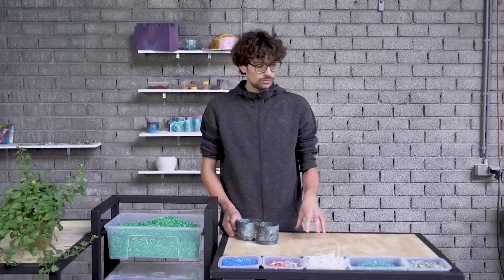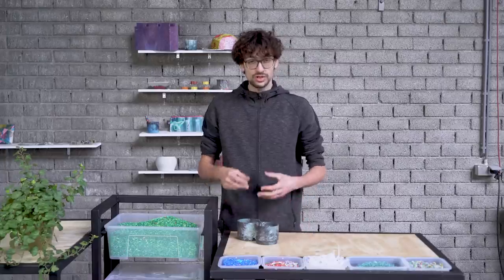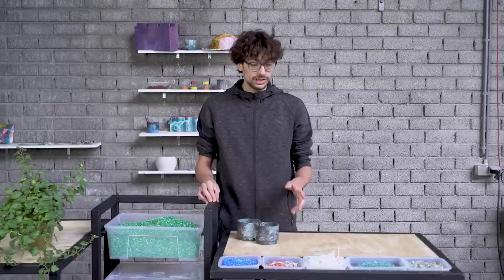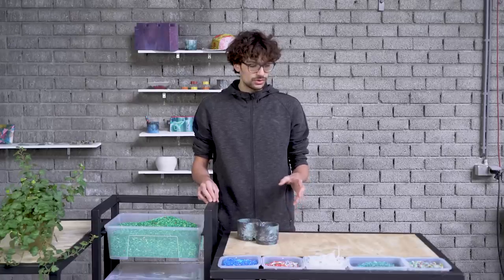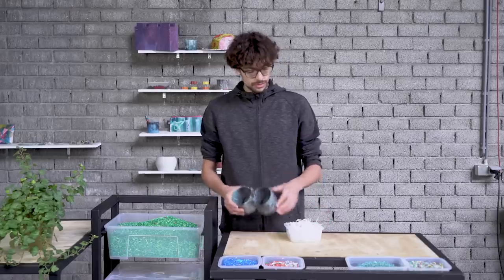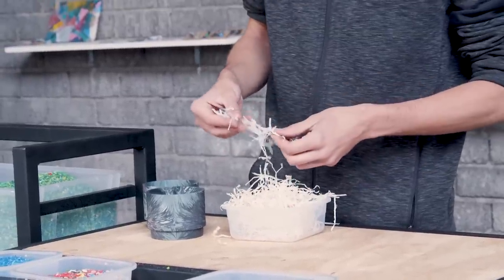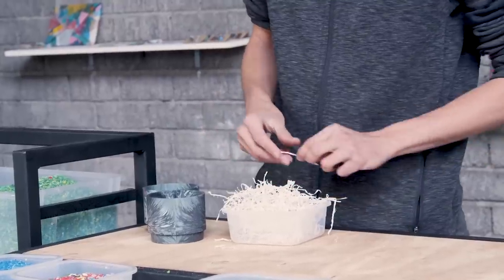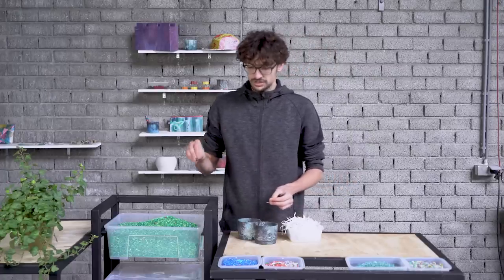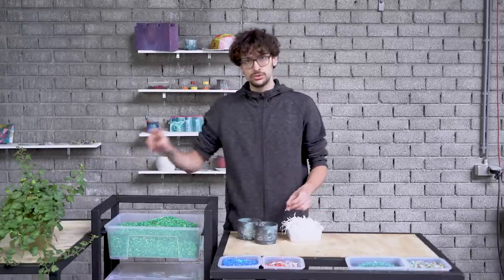You also want to be mindful of all the steps involved in your production and try to reduce the timing in each step in order to be more productive. Last but not least, you really want to treat the offcuts of your process as another outcome of it — not only the product, but also in each step you will generate a lot of plastic dust and offcuts that, if you are mindful, you can collect and classify by material and color again, so you can directly put it back into your process.